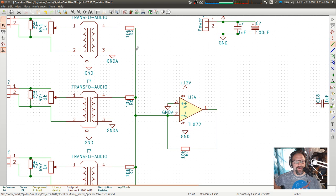So if I've got 10 volts here, that's doing 1 milliamp, and then 0 volts on all of those, so they're not pushing any current at all. Then I've got 1 milliamp coming in here, and it goes through this node, and the only place for it to go is through here, so there's going to be 1 milliamp going through that 10K resistor. So this voltage here, the op-amp has to drive that to a negative 10 volts for that to be the case. If this is 0, and there's 1 milliamp going down here, this has to be at negative 10 volts.